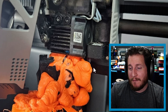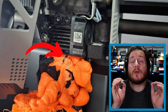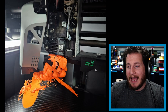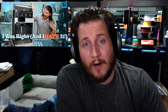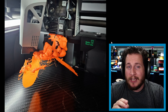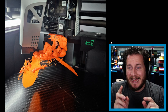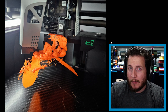Be very careful of the wires — I believe that's one of the thermistor wires right there, and those are crazy delicate. You are going to need to replace the sock, so that one's out of here. Based on all the comments from our six-month review of the Bambu Lab X1 Carbon, I'm fairly certain Stefan is using a Wham Bam carbon fiber build plate. Shiny build plates and the LiDAR on the Bambu don't normally go together very well.